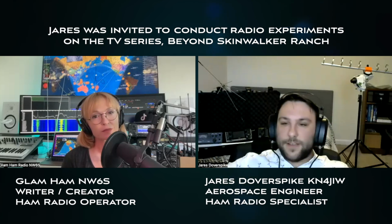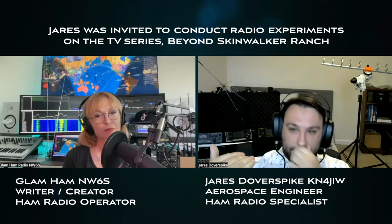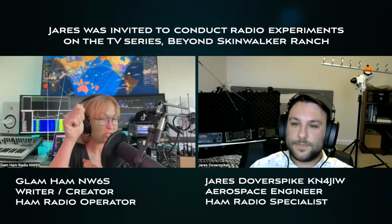Wow. So having it circularly polarized gives you the benefit of not having just vertical or horizontal polarization, but also, whether you have right-hand or left-hand circular polarization, you can still sometimes get those communications as well. Wow. I've never done Earth-Moon-Earth, and most of my antennas are vertical antennas for now. So what direction do you point that?